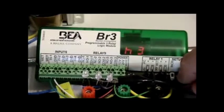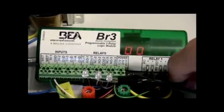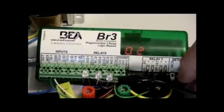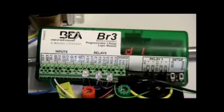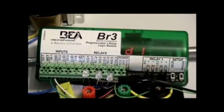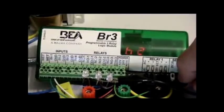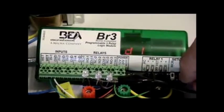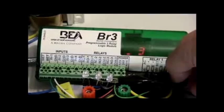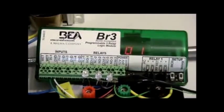Go to H3. The hold time for relay 3 is nothing — you've got to put some time on it so it will at least work. We'll put 2 seconds on hold time for relay 3. Now go to D1 — the delay from when relay 1 fires to relay 2. We timed out so we'll go back to D1. Underscore one is a quarter second, underscore two is a half, underscore three is three quarters of a second, and then one — that's one second. Let's go to D2.